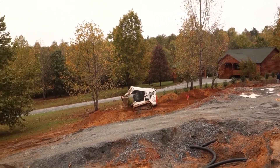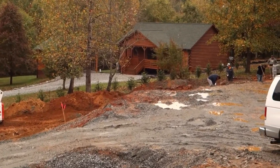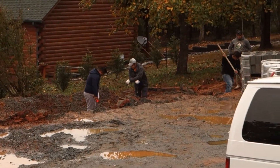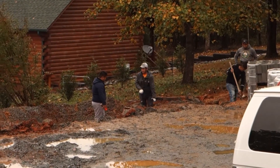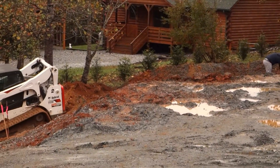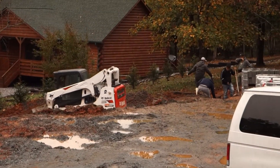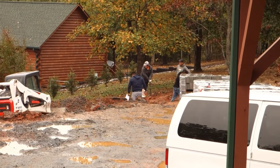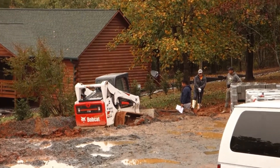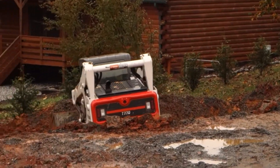This is exciting. Don, tell us what's going on here. Well, they're cutting into the slab of dirt down to solid dirt — the firm ground. And you can see the difference in color. The red dirt is what's down below and the yellow is that loamy soil that was brought in. So they're digging out the foundation area of where the wall is going to go, and they'll be able to lay the brick and build behind it with soil and rock.